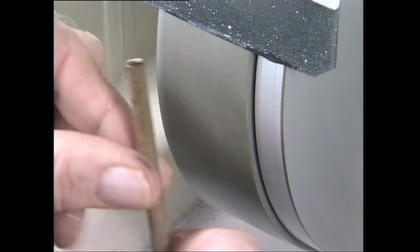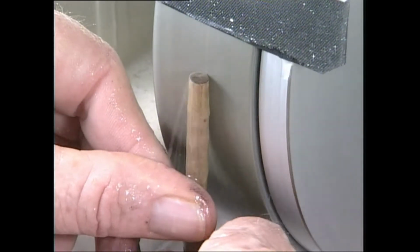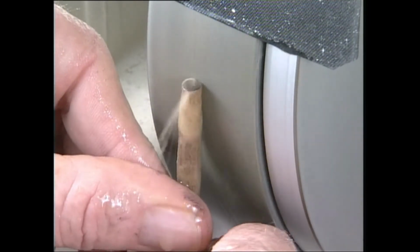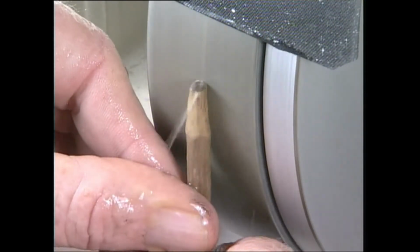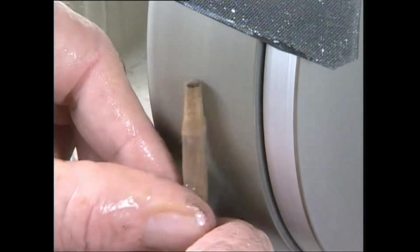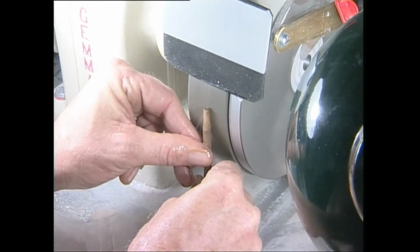Now for smaller stones, what I do here is I taper the stick, sort of hollow grinding it. Now you can do this anywhere you like down the stick. You can make that longer or steeper the angle, depending on how much clearance you want. And you can make it as small as you like, depending on the stones you want to dop up. You must make sure that little pad on the top there is concentric to the rest of the stick. Otherwise, when you're spinning the stone, you'll have problems.